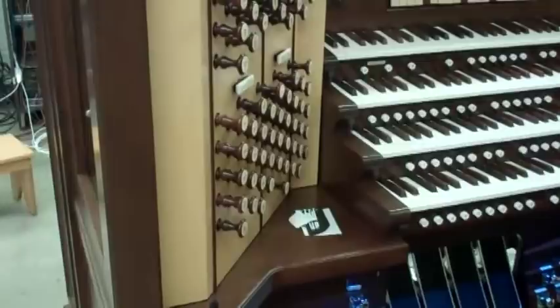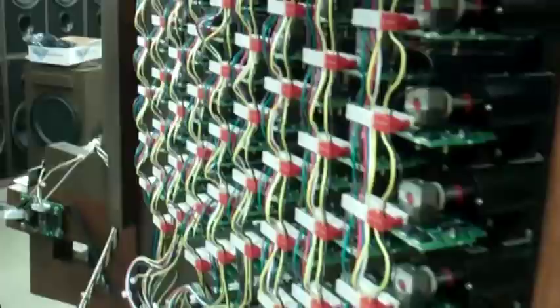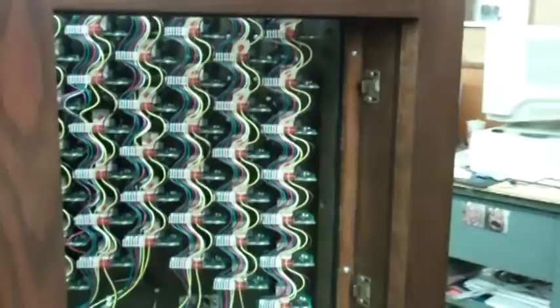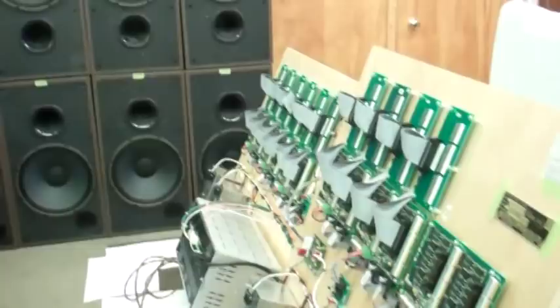It's really interesting to see inside the draw knob jam as well, to see how each draw knob is wired in series with all of the others. Now that the console is not fully put together yet, we can see the wiring harness that makes it all work. All of the components — even the individual draw knobs on an Allen console — are connected by plugs and not hardwired or soldered. And that means if something needs to be changed out in the field, it's a relatively simple process for the serviceman because there's no soldering on site. That goes not only for the draw knobs, but for all of the circuit boards in the organ.